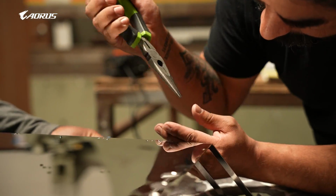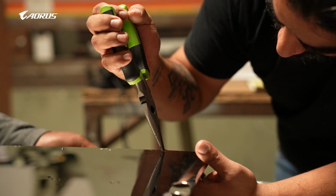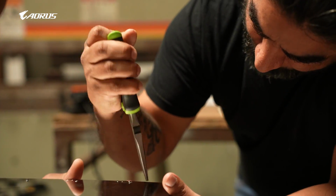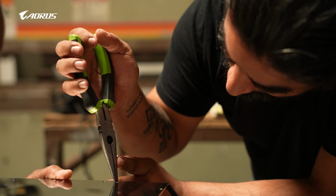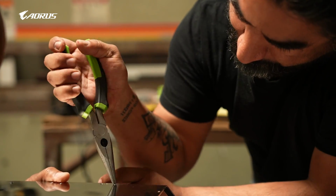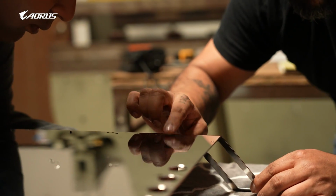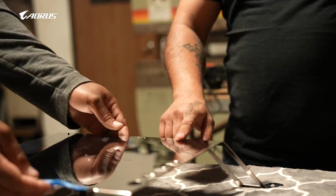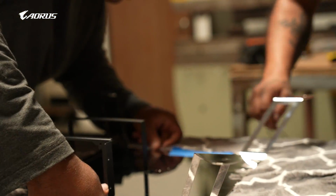What it is, a burr. As the metal goes through, it heats up and melts a little bit. So what you want to do is clear the backside, for one, for safety, because it will really cut into your hands, and for two, you don't want it to mess with whatever's going through there. So take away that extra piece of metal, and that's what cleans it up. Also, the quality is better when you do that. Perfect. These were okay? Yeah, these were okay.